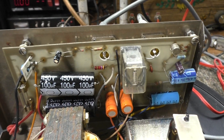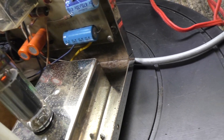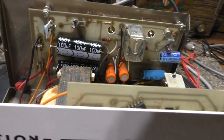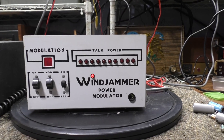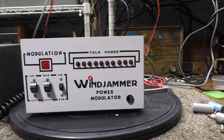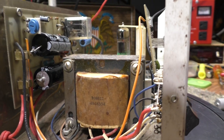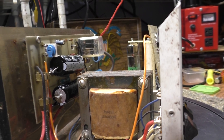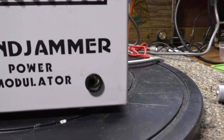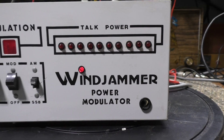Here's the inside — circuit board for the components and the tube mounted on the steel chassis. There's not much to it. Small transformer — a lot of modulators, especially small amps, people overdrive them and try to get too much out of them. These are made for low dead key and high swing. Look at that little transformer there, not much bigger than a filament transformer. The adjustment is you get your little hex tool, stick it in that hole to set your dead key or make it variable up and down.